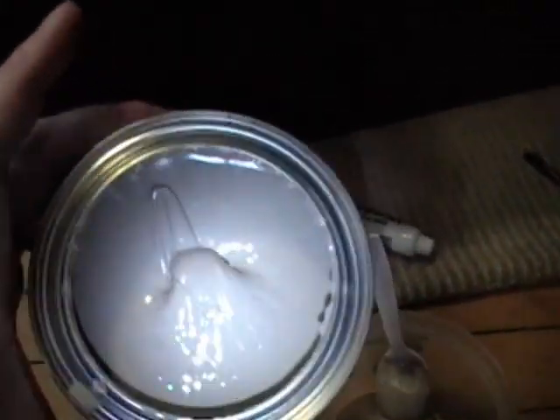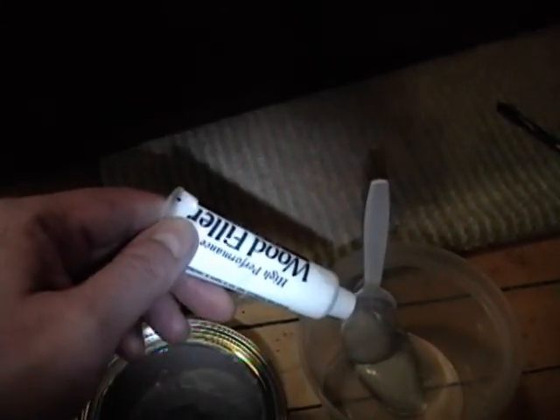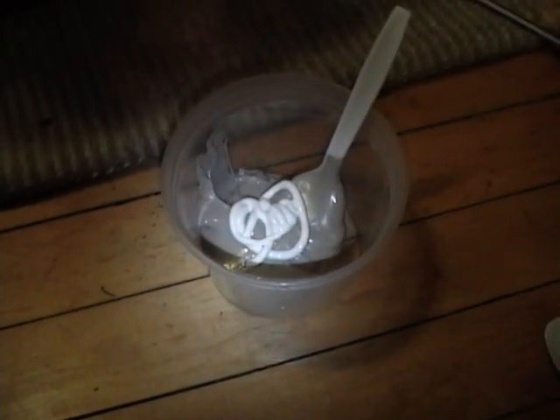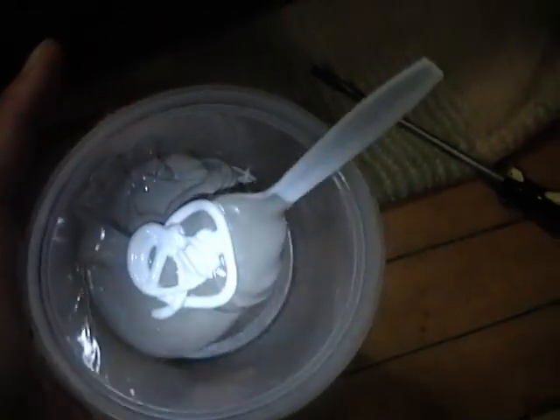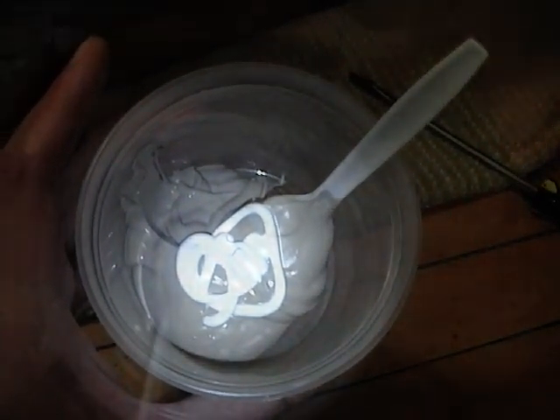Here's what the wood filler looks like when it's still in the can — a gray thick substance. You're supposed to put in a little bit of the hardener, a ratio of about 16 to 1, and then mix it up thoroughly until you don't see any more of the white hardener. Then you've only got about ten minutes to work with it. I'll start glopping it into the voids. They say to only do about an eighth of an inch at a time; otherwise the center won't cure. So put it in a bit, a little bit more, until it's filled up flush to the top.